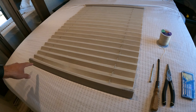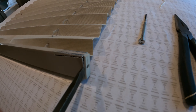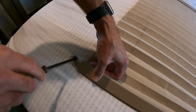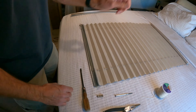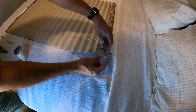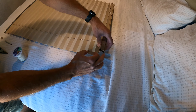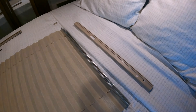The first step is to remove the bottom rail by using a flathead screwdriver and prying here to get the plastic end piece off. Do the same for the other side and then slide the bottom piece off. Next, take the top trim piece off in the same manner. Take note of how this goes back together — there is a specific way it has to go back in. In ours, these top two pieces fit into the very top of the track.